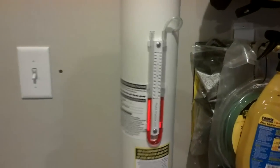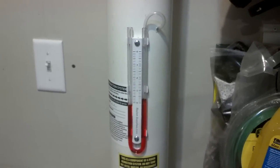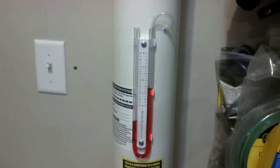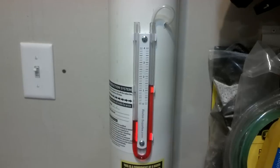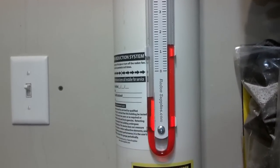You have to have a flow meter — it's reading zero right now. If I turn the switch on to the fan, as you can see it's going to start sucking air. Considering this has two 45s and five 90-degree elbows and goes up over 29 feet to get to my roof, we're getting a reading here of about 1.5, which is really pretty good. I'm very pleased with that. We should be able to take that radon value down to a very nice level — we're hoping to get it down to about 1.5 or less. Now we've got to do some testing in the next week and see where it ends up. I'll let you know how it goes. Thank you for watching folks — please subscribe to our channel to see more projects that we do around the farm here, and like the video if you can.